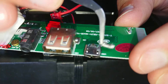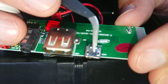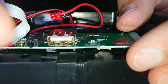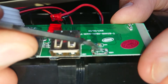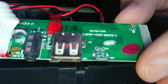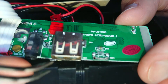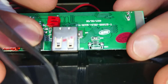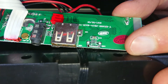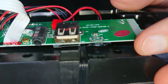Let's do a little surgery on this socket. The socket's totally stuffed — the back end has just come out, that's definitely the contact pins that have come off. The whole section has actually been completely busted off the board. There are some tracks missing on the board. Hopefully they're not the ones we want. I think these two tracks are what we want — we might have to bust the microscope out to have a closer look.